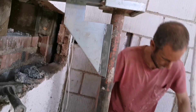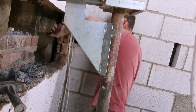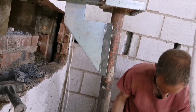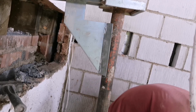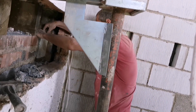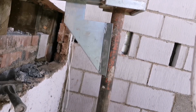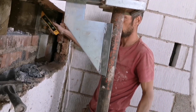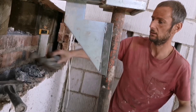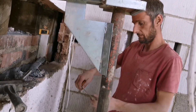Just mixed a bit of sand and cement up for the pad stones to bed in. The steel needs to go 150 onto each pad stone, and that's for any lintel — you need 150 millimetres of bearing, which is 6 inches.